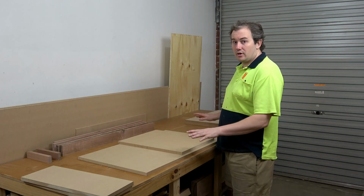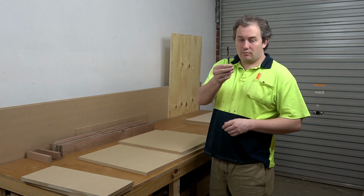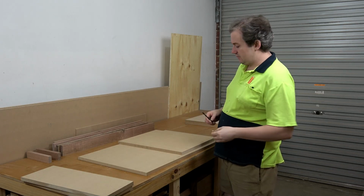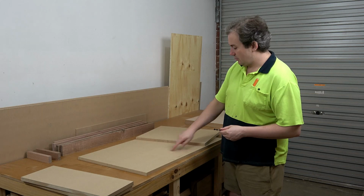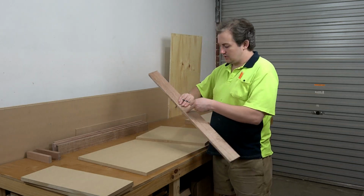So with all of these components marked out with the dowel locations, I'm now going to drill the dowels using an 8mm brad point bit for an 8mm dowel, which is 38mm long. So any of the holes that I need to drill through the face of the panel, so into the face of the bottom in the middle there, into the face of these side panels, into the face of the rails here in the middle there,